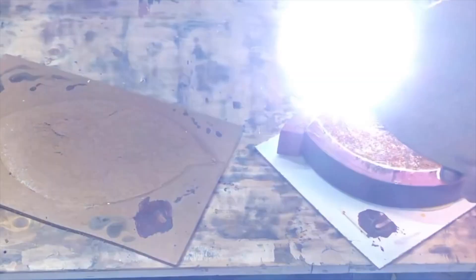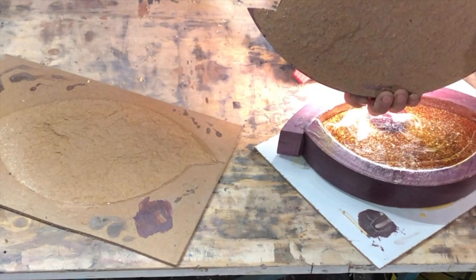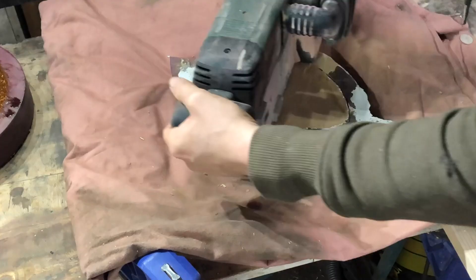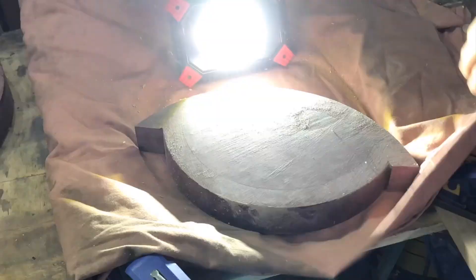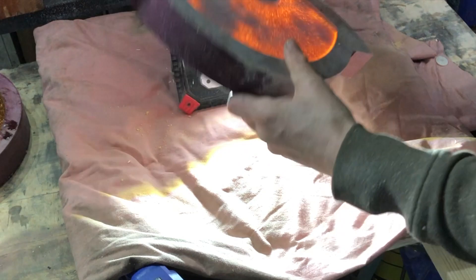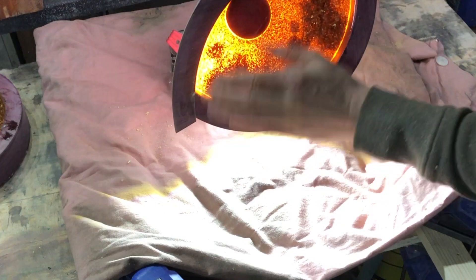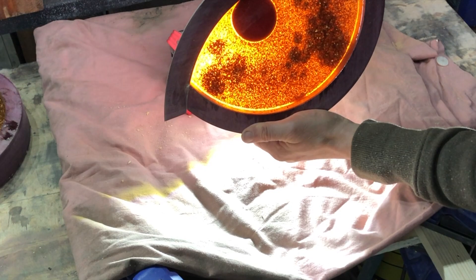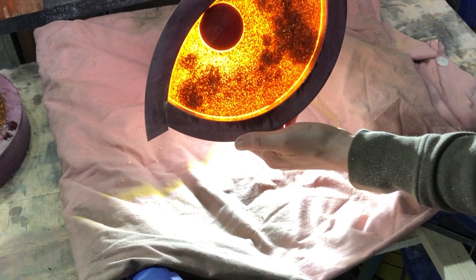Let's have a look at the other one - a bit thick on the leaf there, because there's more MDF on the back of that one. I'm going to sand the back off before I even do anything on the front, just to see what happens with the light coming through. That might determine if I make them wall-mounted or some sort of stand. Now that I've taken that off - wow! You can see where some of the flakes are a lot thicker. For next time: far more even spread of the flakes. I think mixing it up in the resin just prior to pouring rather than letting it sink in the resin as I'm pouring. But in the interim - wow - that's on fire! Given this, I think yeah, wall-mounted.